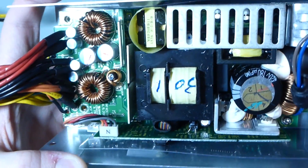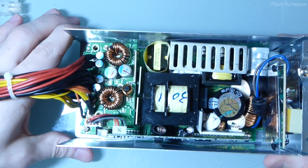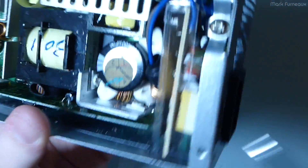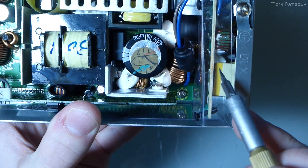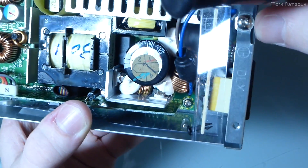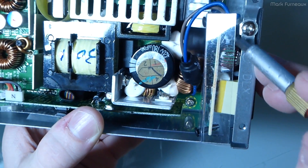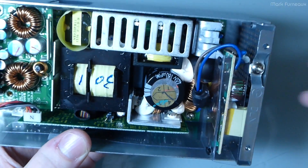Without doing a lot of analysis there's no easy way to tell. This is a great power supply, however it isn't perfect. I've noticed some things I don't particularly like on the manufacturing side. For example, this cap here is a little bit askew, this leg is a little off — it's not all the way through the board, though it's still making connection and will work fine. These wires don't have any strain relief on this side, and they're a little more flexible than I'd normally expect.